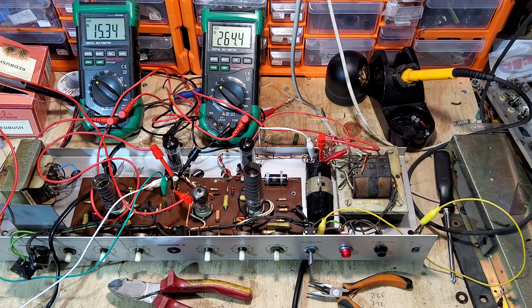The cost argument is compelling: a pair of JJs would be nearly 40 quid, Sovtek or Tungsol you're talking 50-60 pounds. These tubes stand me at about two to three pounds each - I bought 50 of them for about 70-75 quid. So if they last a couple of years that's still cheap. The 12W plate dissipation and 2.5W screen dissipation should be fine - if we can match the voltages up, I think we'll get away with it.